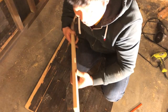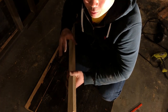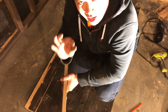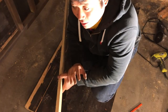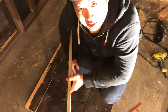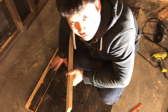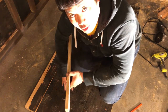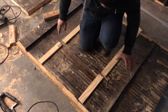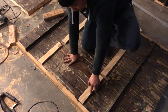To further help stabilize these boards, I have this laminated plywood — I'm going to glue it on and screw it down to each of the boards. That's not going to give it much structural strength, which it already kind of has, but it's going to help each of the boards not move independently from the one next to it. That's important because when we get a nice smooth sanded surface on top, we don't want it expanding and contracting or sagging — you'd start to feel the individual boards. I want a nice smooth surface that stays like that. So I'm going to cut this piece down and put a couple of strips on each piece, glue it as well as screw it.